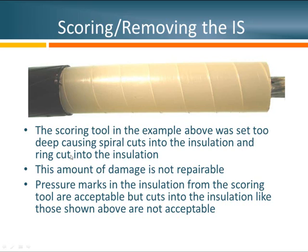I'd like to mention that whenever you're using one of these tools, you'll sometimes see pressure marks in the cable insulation. This is very similar to writing on a pad of paper, then ripping off the top sheet and finding pressure marks on the sheet below. The same thing happens in a cable. If we had just pressure marks, we consider that to be okay — if the cable warms up enough over its life, those pressure marks will actually come back out.